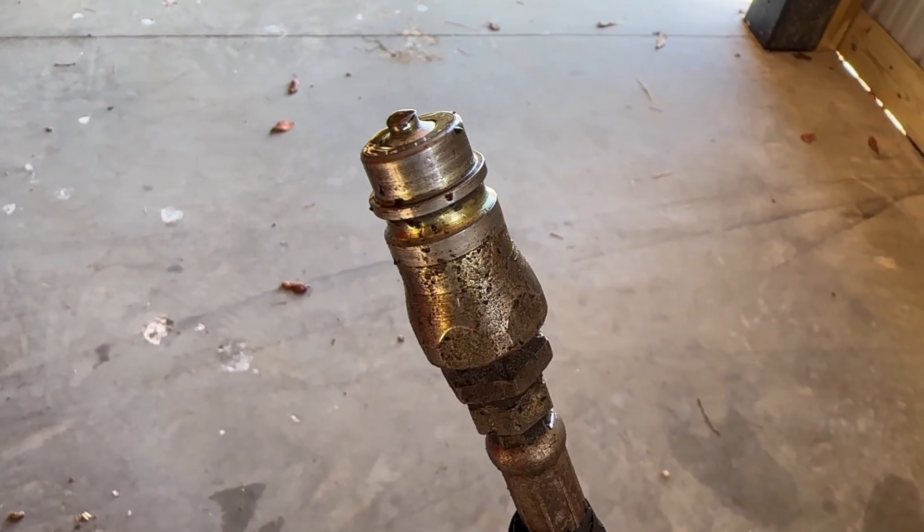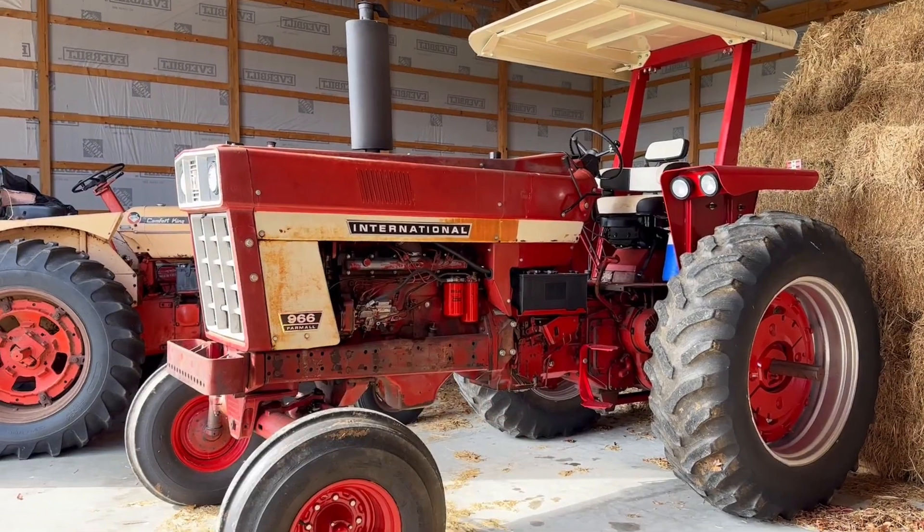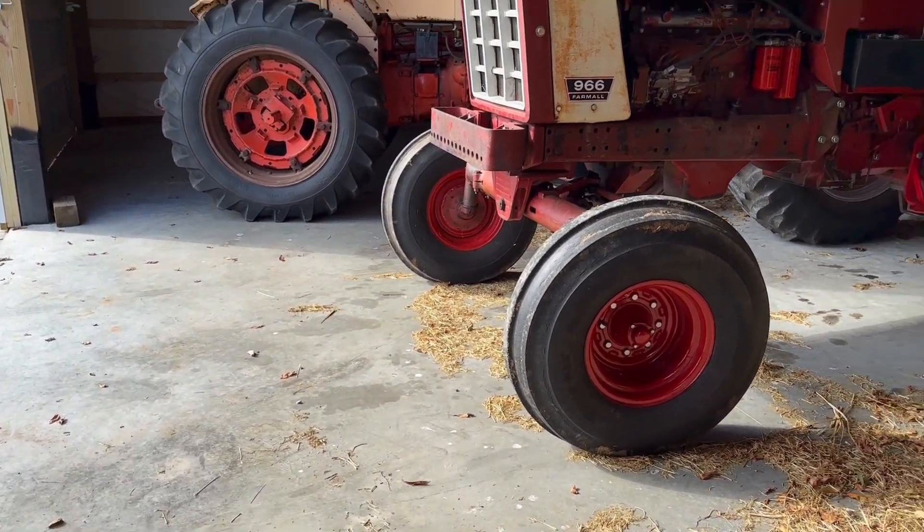The AGCO was the only one that could run any piece of equipment. Your standard hydraulic coupler nowadays is pioneer - this is what pioneer looks like. Every piece of equipment I have here came with pioneer when we purchased them. Even the Krone pieces, which are not necessarily American, do have pioneer. Some adapter brands and some tractors may handle adapters differently - the 966 is a pain because it leaks so much, and converting it properly is definitely a project we're going to do this fall. That stuff's expensive and I don't want to keep losing hydraulic fluid.